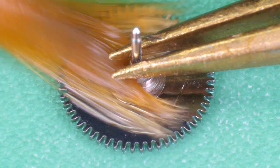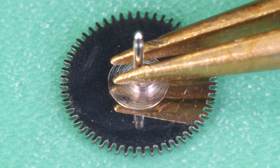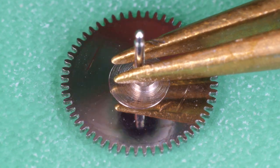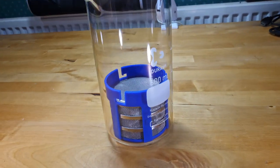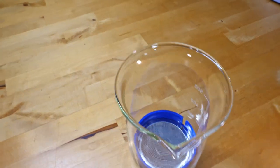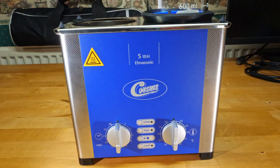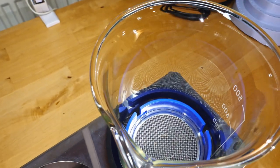I'm disappointed. I didn't want to start cleaning by hand. The purpose of this purchase was to avoid the standalone ultrasonic and speed up the workflow, but it looks like that's what will have to be done with some parts. I don't know how it's going to be with dirty movements — this was only a test movement that's never been in a watch. The basket frame with the three baskets fits nicely in the Elma jar for the ultrasonic. So instead of using the first bath with the cleaning fluid, I could put it in the ultrasonic for five minutes, then attach it to the machine, spin off the fluid, give it the three rinses, dry it — and that should come out nice and clean. It will be a little messy, but it will work.